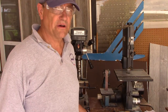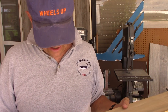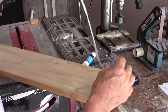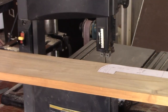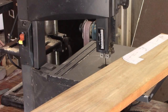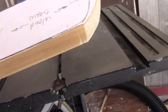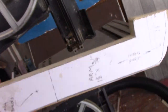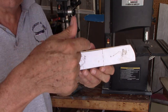Next we'll press on to the arms. We did the same thing on the arms. Here are the arms — just cut them out of the pattern. Choose a nice clean piece of wood, glue the pattern on, and cut it out with the bandsaw. We got number one cut out. Got to have two of these — they're identical. The wood piece is identical, so I'm going to sand this one smooth and then use it to trace for the second one, so I get a smooth pencil line.